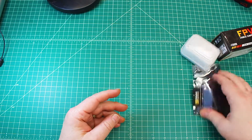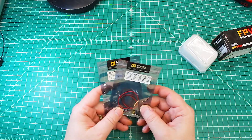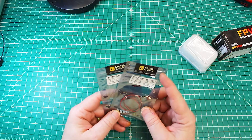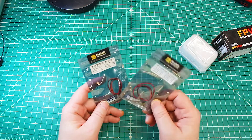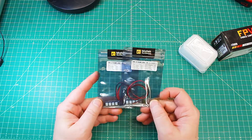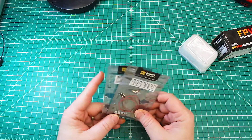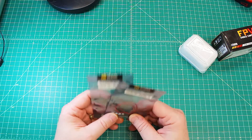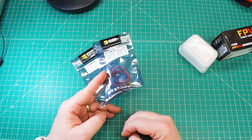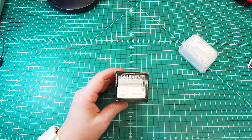A couple of standard LEDs — these are the ones I run, they run straight off of LiPo power. Now that I say that, I realize these probably will not work because they only work from 14 to 17 volts. We're going to be running 5S at times, which pushes us to 18.5 volts, and if it's 6S these will not work. So we're going to have to get something that runs off a 5-volt regulator.